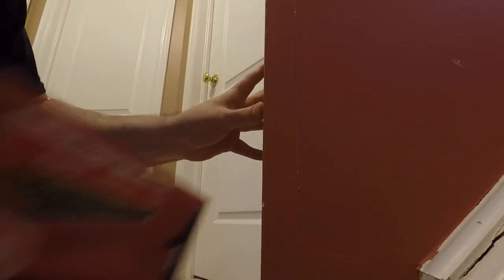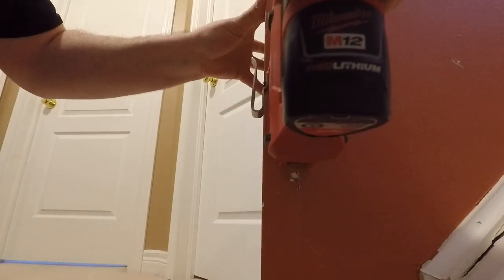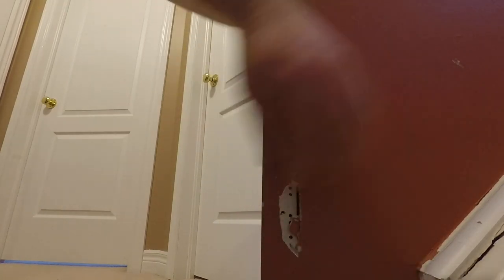So what I'm going to do is take my stapler. I'm going to make sure the bead is tight to the crack and I'm going to staple it. You can never have enough staples. The paint is going to bust up like that — it's no big deal. You actually want any of that loose paint to come off. Even though it's not cracked up here, I'm still going to staple it just in case.